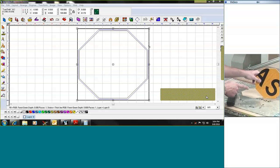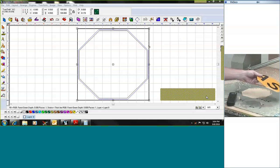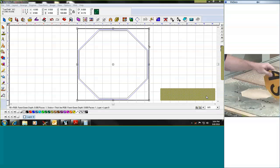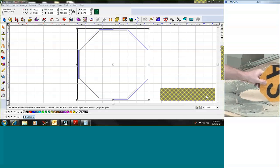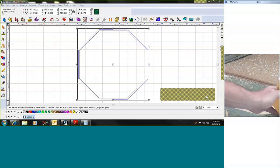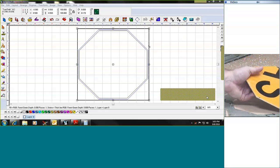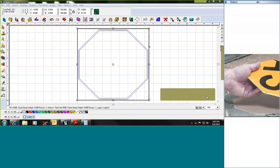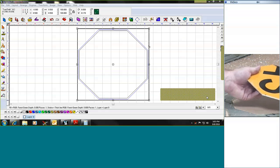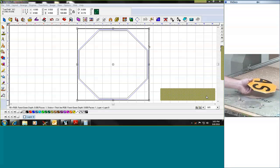Let's see if I can get you in where you can see the edge quality. There we go, that's a little bit better. If I look at the edge of the actual piece — and I'll go ahead and send these out to you so you can look at them — the edge quality is very good, as well as the cut through the material. So again, we cut this particular piece of eighth-inch aluminum using the VR-48 router engraver using the router head. We did it in two passes: a single pass that cut about 90% of the material, and then a secondary pass that cut the remaining 10% to get through the actual piece. And we used the vacuum table to hold our pieces down.